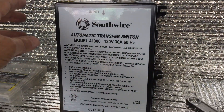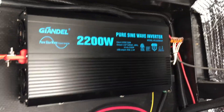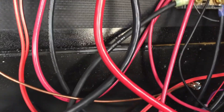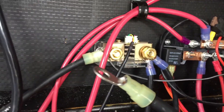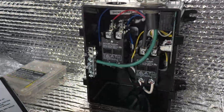This is my switching box. I have a 10 gauge wire that goes up and over to my inverter — I've got a 2200 watt inverter mounted right there. On this end I have my battery cables. The black one I need to hook up to the shunt because I want to be able to monitor how much power is being drawn through this whole system. I have a little meter on the side of the wall inside the trailer for easy access.